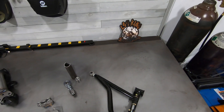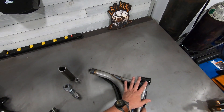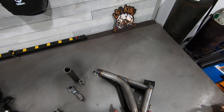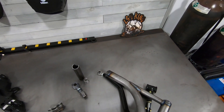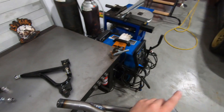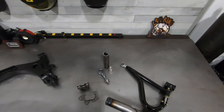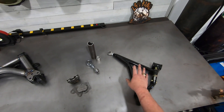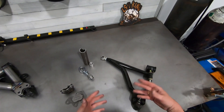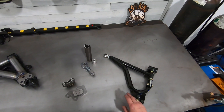Just by looking at them side by side, you can see the footprint of my arm is a little more shallow in relation to the turning radius. One reason we did that: on super high horsepower builds running really big tires, we wanted to gain as much clearance as possible at full lock. I've been able to fit a 285/10.5 on my Monte Carlo and still clock the wheel left or right with very little interference — just a minor adjustment to the pinch weld inside the wheel well. ZZP's inventory has been sporadic, though they just recently came back on the market.